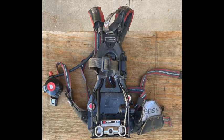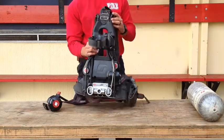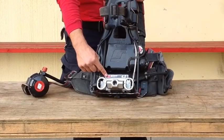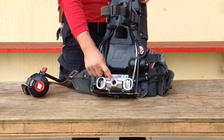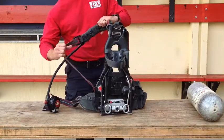Specifications: back frame and harness assembly. The solid, lightweight, one-piece polycarbonate back frame has a bracket for mounting the pressure reducer and sensor module. It will allow for a connection of 30, 45, or 60-minute cylinders, but a 45-minute bottle will be used. It's made of heavy-braided webbing with no screws or bolts.